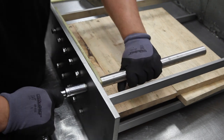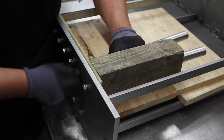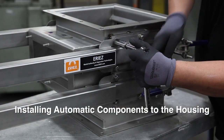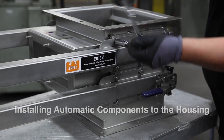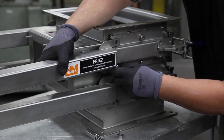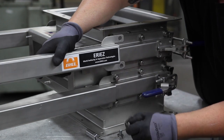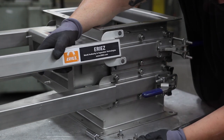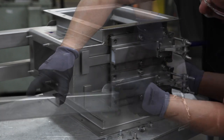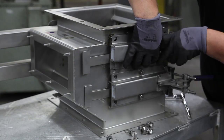Set the new carriages aside on non-magnetic surfaces until they're ready for installation. Remove the 3/8 bolts from the side of the housing to remove the manual style slides, clamp assemblies, and guide guards. It's best to start with the bolts that are in the rear, as they hold on to the slide guards coming off the rear of the unit. Repeat this for both sides.